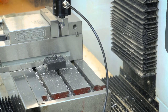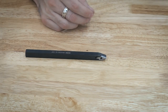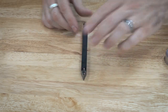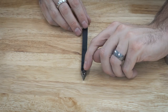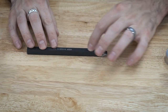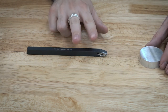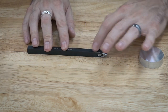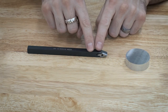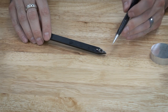For the Z0, I need to find that tip right in the middle. Since this is 3/8 inch wide, halfway down is 0.1875. So if I indicate off the top, I can just subtract 0.1875 and that puts me right there. I used a 1-2-3 block to reference off the top, moved the workpiece down until it just barely touched, then added the size of the 1-2-3 block plus 0.1875, and that gave me my zero point right on the tip.